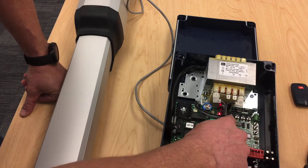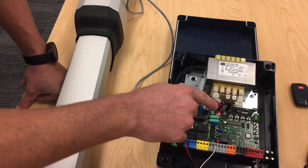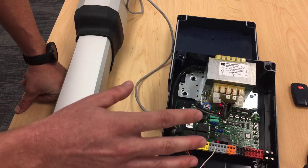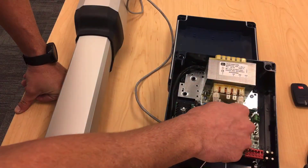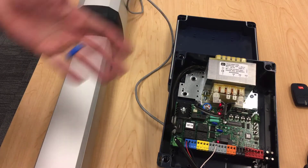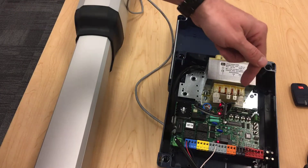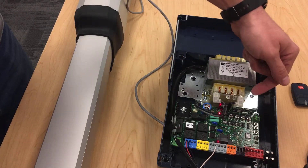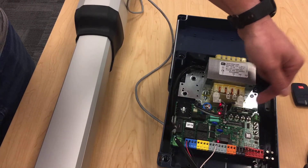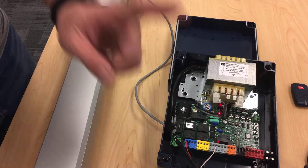There are also some dip switches. Dip switch number one is defaulted always on, and that's for remote programming. Dip switch number five is for photo closing — you want your photo beam to work only while closing. My basic setup has T1 all the way off because we're not using the closed timer, T2 to 12, T3 all the way counterclockwise, and T4 all the way counterclockwise because we're using one motor.